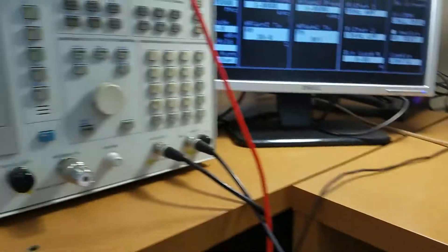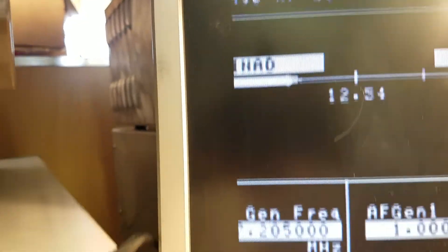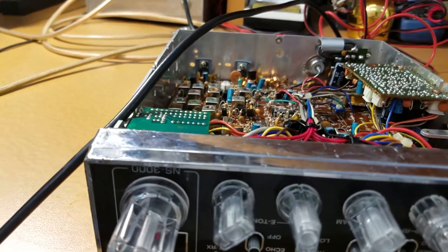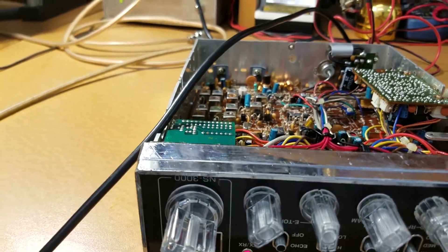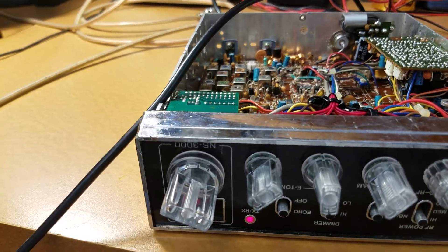With the NS3000, we've got her on the machine here. The way it is right now, it's bouncing at 12 dB, sitting at negative 93. Not too excited about that. So we're going to have to do some work on this — probably going to have to do a full alignment. Everything's been turned in this radio from the get-go. We're going to jump into this thing and see what we can do.